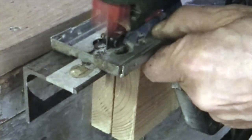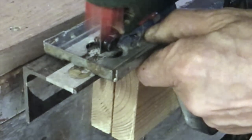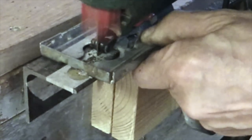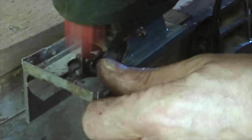After I've drilled the holes I'm going to cut the slot out with my jigsaw, making sure that it's not too wide so that it traps the head of the coach bolt to stop it from turning. The slots have to take up belt tension by sliding the motor along them and then clamping it down with hold-down clamps.